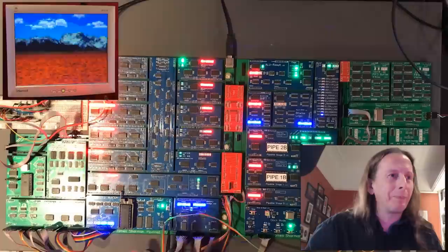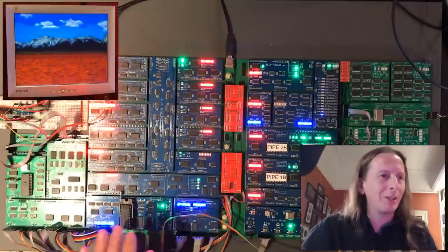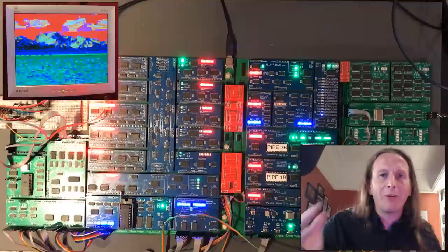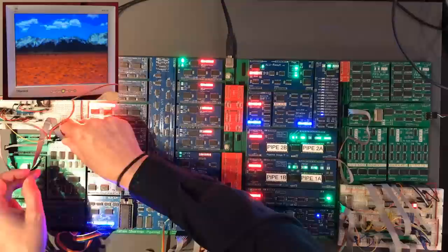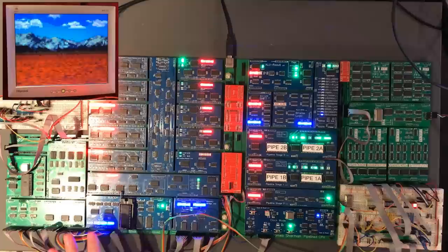because the register values are getting inverted, but now the values being placed onto the memdata bus for the tilemap board are also getting bit reversed, so it starts to work correctly. But if I rerun the code, the same bit reverse is happening to the color data, so that messes up. But I can also swap the DuPont cable around to reverse the order of the bits on the output. So with those two circuit changes, this board starts to work correctly.